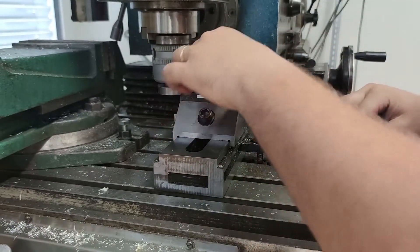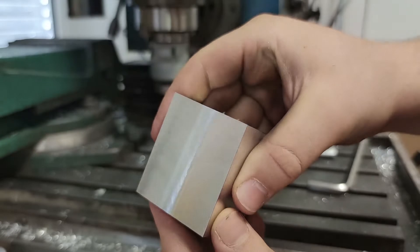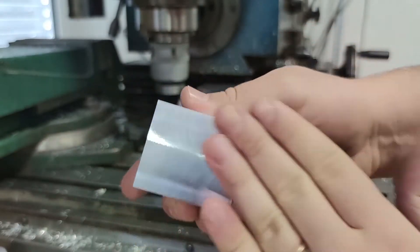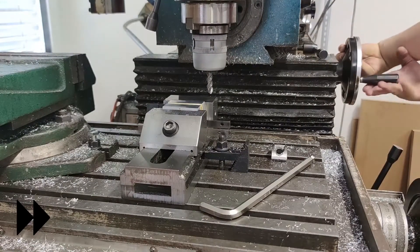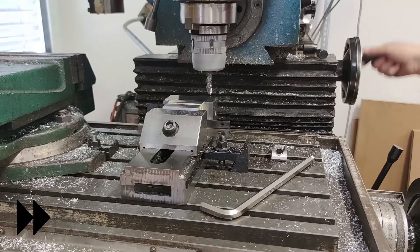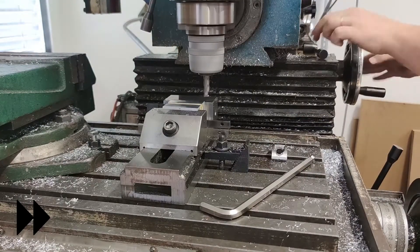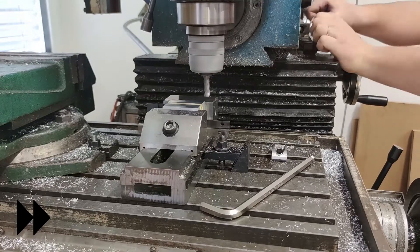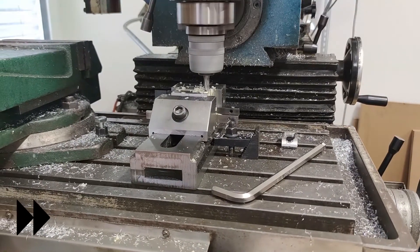Before boring all the holes I had to make sure I would be able to slide the bearing onto the rail and ensure that the slit was wide enough. I milled one bearing block with a flat end mill, but for all the others I later made a special fixture for holding them at an angle, because the rail supports were tapered.